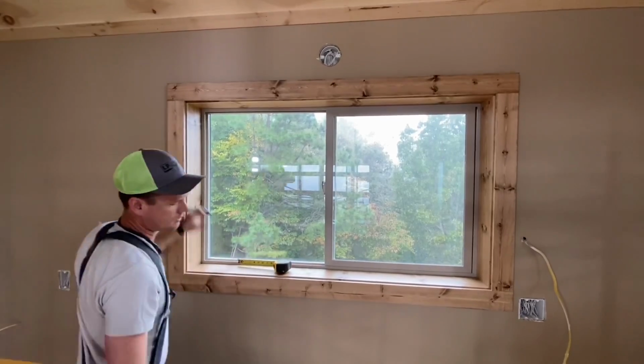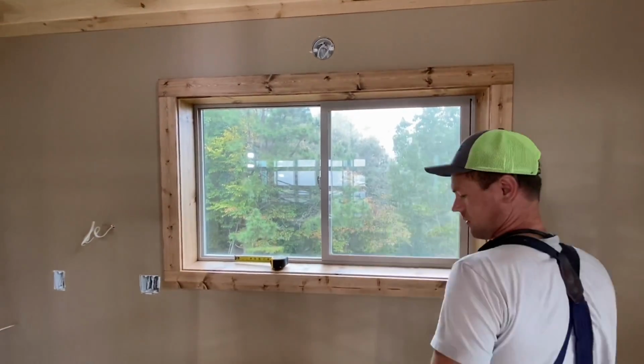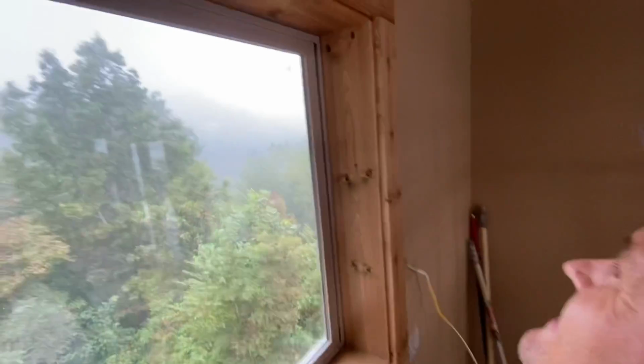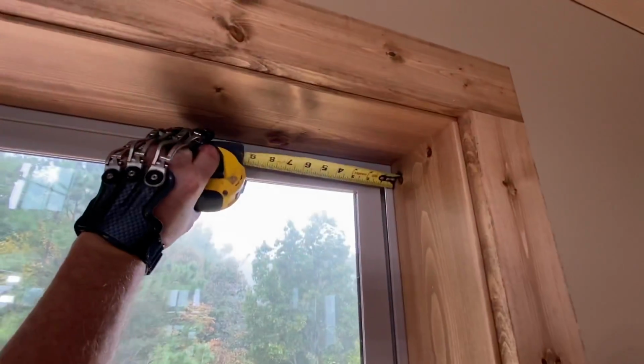One of the most important things to do, if you do this yourself, is to undersize your window trim unit from the framing size. So I make mine at least 1/4 inch smaller in any and every direction. Some of the windows are triangles, so you can't just say it's left and right. You always need to undersize. That gives you room to slip it in without a struggle, and then it gives you room to actually move that and align it with the window.